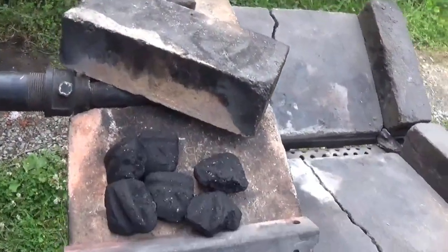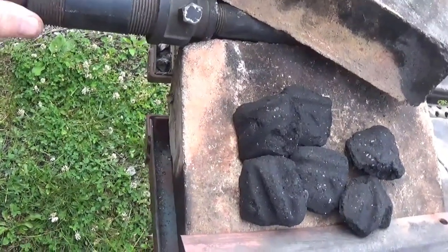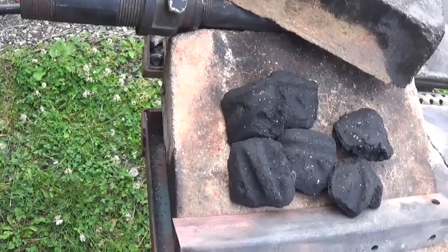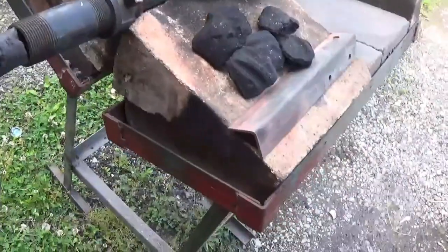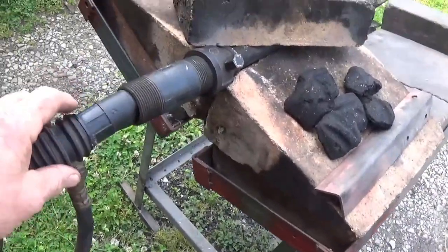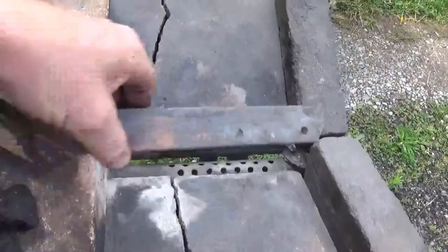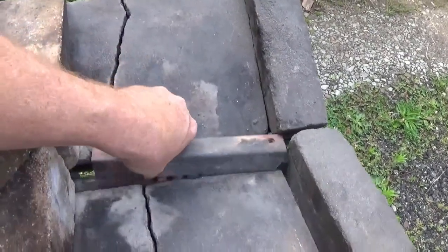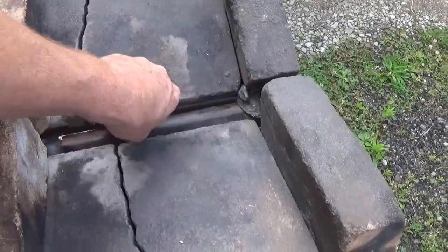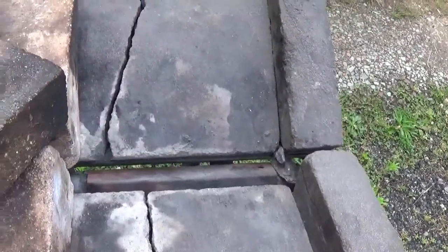The changes I made to this basic forge: this is the air inlet, it goes down through a blower motor. What I've done is replaced the piece that used to fit into the header down here with an LP — liquid propane — burner. So I start the fire with charcoal. This will allow the ashes, once it's done — called clinkers — to drop down through the bottom.